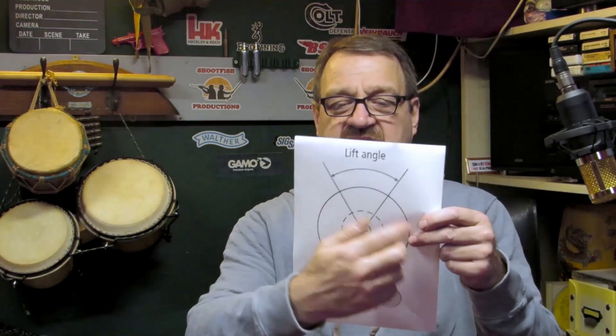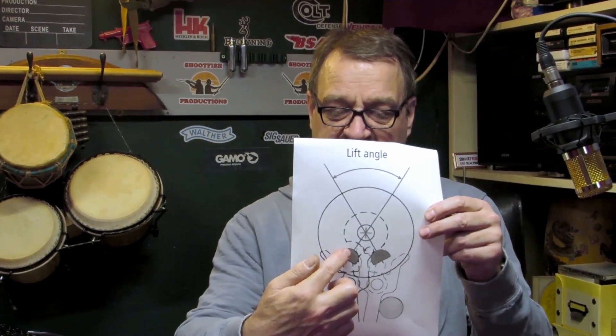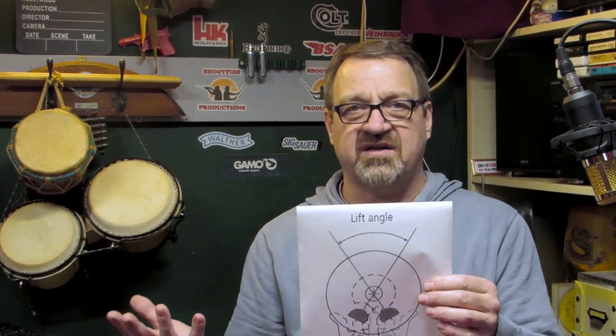That's how they use these readings to find faults and assess the health of the watch. A good amplitude is healthy — around 240, 250, 260 degrees. If it gets to 360 you've got a problem because the wheel is then going all the way around and you get what's called 'knock.' A good average lift angle for a lot of watches is around 53 degrees — I think that's correct for my Seiko. You normally look up the manufacturer's charts and specifications.